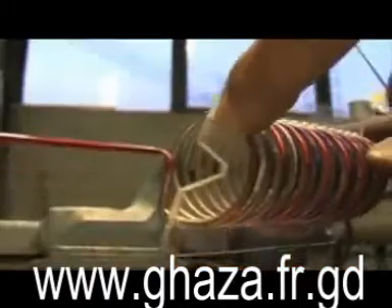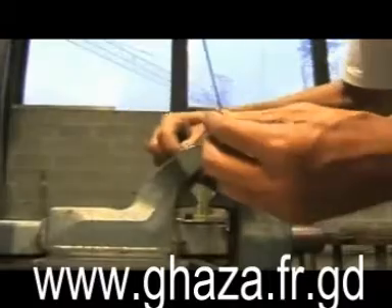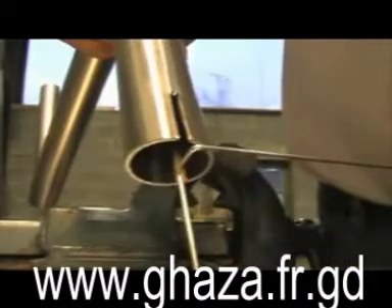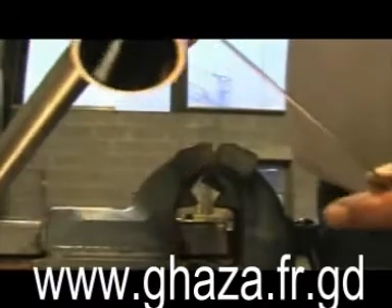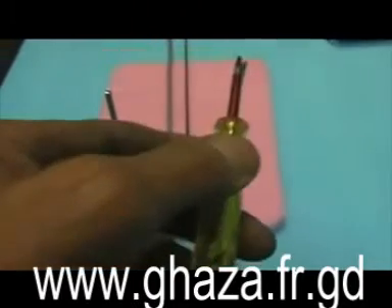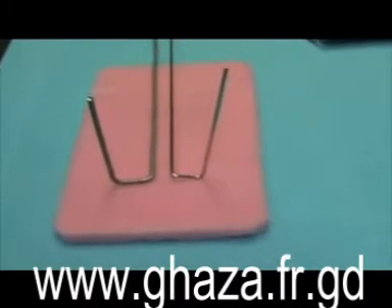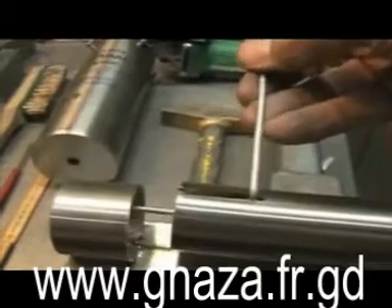And this is what you get. In order to do this kind of shape, I'll show you how to make it. You take it this way — it is like this, two times 90 degrees. The reason for all this is so you put your wire in here and you have the possibility to turn around. You can bend your wire towards the right and up, or towards the left and up. Depending on how you bend it, it decides on which side the coil will be turned — left or right. That allows me to turn right ways.